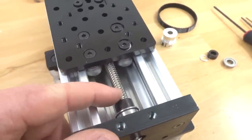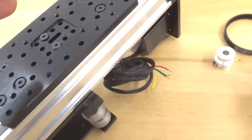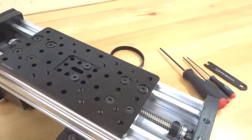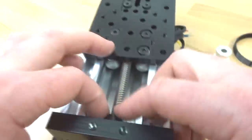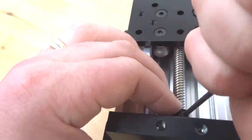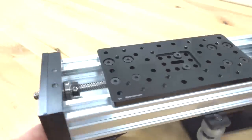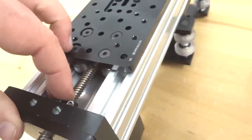Keep these parts close to this side of the C-beam end mount. As you can see, our lead screw is protruding through — stack on our lock collar, 8mm shim, and flanged bearing, and continue to rotate our lead screw through. Now lock in our flanged bearing to our C-beam end mount. Making sure our lead screw is flush with our C-beam end mount, tighten down our lock collar — make sure it's nice and snug; we don't want any movement in this lead screw. Move on to the opposite end, push our flanged bearing into our C-beam end mount, and tighten down that lock collar.